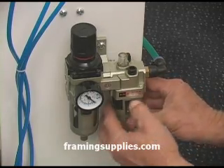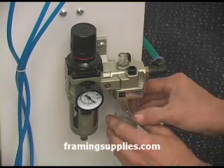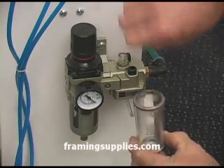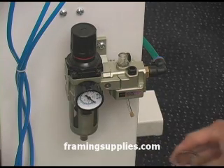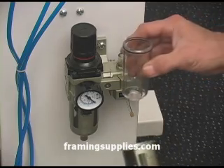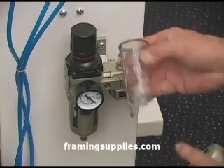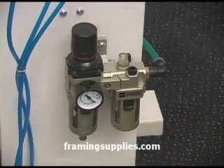This is how you fill the machine oil reservoir. First, you pull down on the clip on the front of the oiler outer shell, turn it, wiggle it, and pull it down to remove the outer shell. Next, you pull the acrylic container down while wiggling it. You pour the oil into the acrylic container. You will need to line up a key in the bottom of the acrylic container with the outer shell notch. If you don't do this, you won't be able to reassemble it.